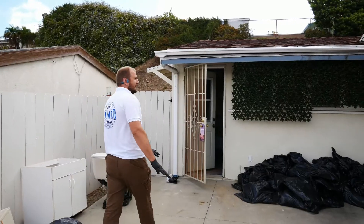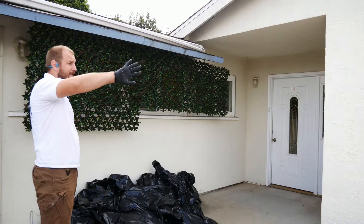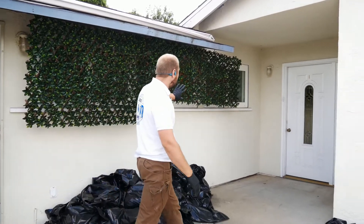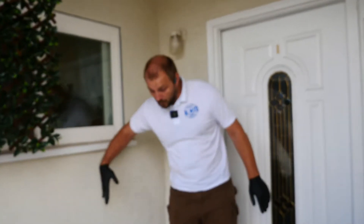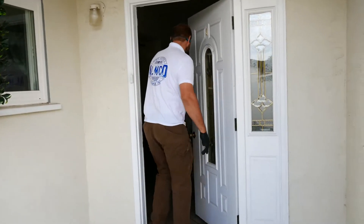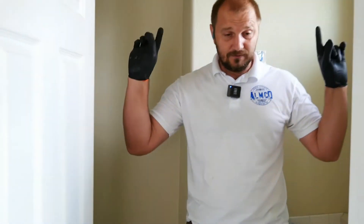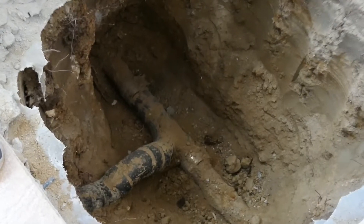Here are the difficulties in this house. This section is the original house with the original entrance, and this side was built later — built above the original cast iron pipe. We have a bathroom here — a standard back-to-back bathroom — then the pipe goes through the hallway and through the middle of the house. There's a bathroom on the second floor and a bathroom on the first floor, all ABS, tied in and connected to the cast iron pipe.